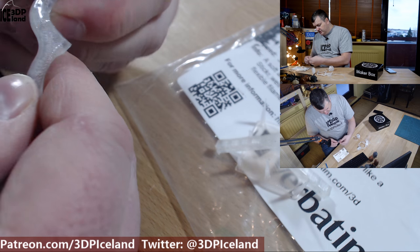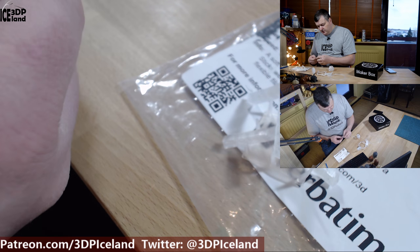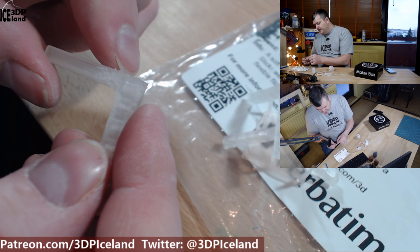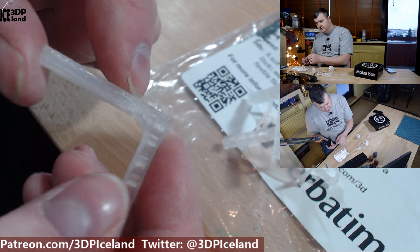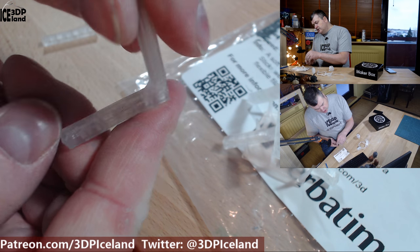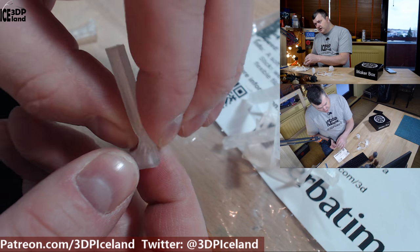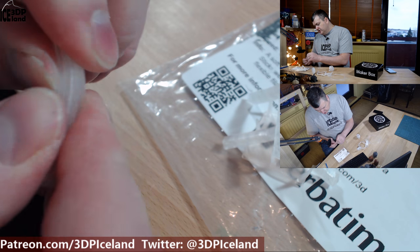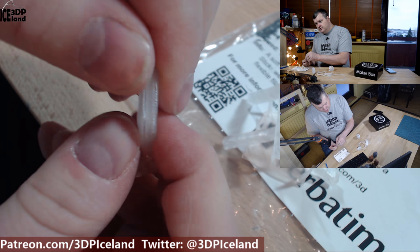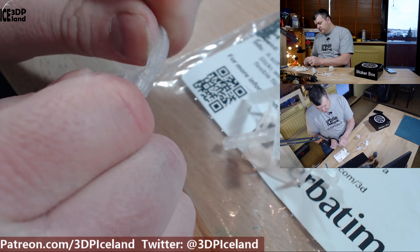With an upright part it was coming out pretty good, but I had been printing a little too fast. I slowed down the print to get it in better shape — printing it upright meant there wasn't enough time for the filament to cool down. After slowing down, the layer adhesion in the standard print still won't delaminate, so it's just extremely tough and flexible.